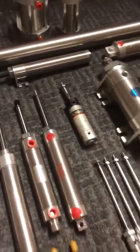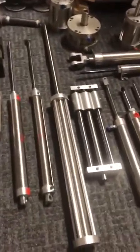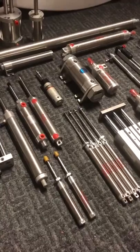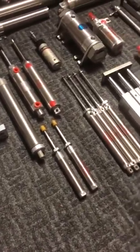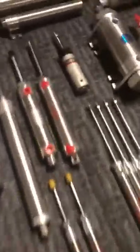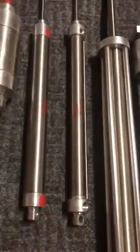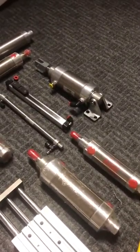So one of the questions that I'm asked the most is, how long will these props last once you build them? And to that, the answer is, it depends on how you build them, how well you build them, what parts you use. With air cylinders, you're working with a lot of air pressure, about 80 to 100 pounds a lot of times. And with small cylinders like this, or cylinders that have a really narrow bore like this, over the high air pressure, it's potentially going to move extremely fast. Such as something like this, which is what I use for pneumatic electric chairs and stuff.